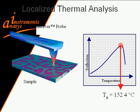What we do is pass more and more current, heating the cantilever hotter and hotter, and measure the deflection of the cantilever. In the early phases, the material of the sample will thermally expand and push the cantilever up, so we see the deflection increase. At a certain temperature, the material underneath the tip will soften, and the tip will penetrate slightly into the sample surface, causing the deflection to turn around.